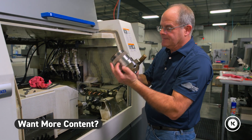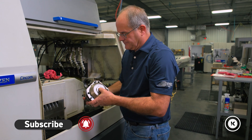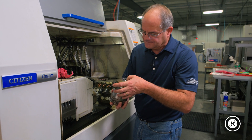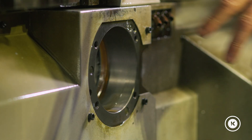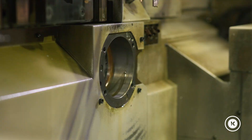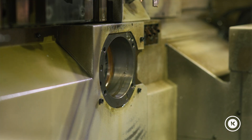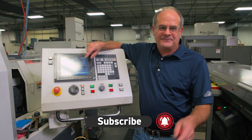There it is — there's your guide bushing housing. This is what your perishable guide bushing goes into. This is what supports your stock. It's driven by the main spindle by the belt that we took off and has bearings in it — it can be rebuilt. This one feels pretty good. So now what we see looking in there is this separate casting right here that we're going to indicate next. That's going to make sure that our guide bushing is in line with our main spindle — that's where we want to start our alignment check. That's the end of this video. Be sure to like and subscribe and check us out on the next one.